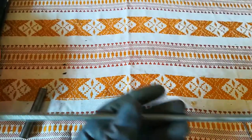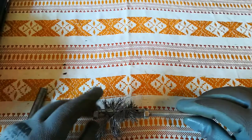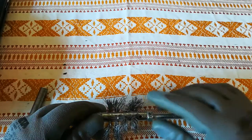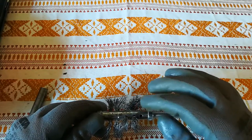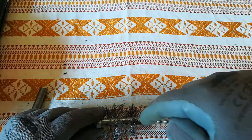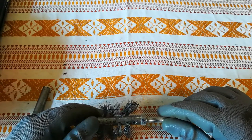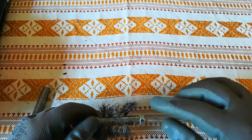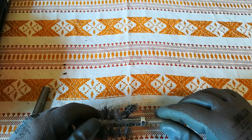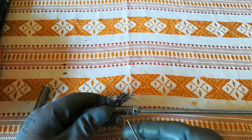So let's start with the construction — how you make it. First, what you need to do is tighten two nuts to hold this piece of pipe together. Then you take a drill and simply drill through. I used a 3mm hole for this because it works great for this steel wire, this steel cable — it's a cable from bicycle brakes. As you can see, it's cross drilled like this.